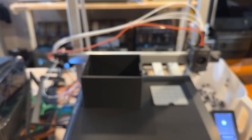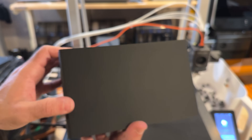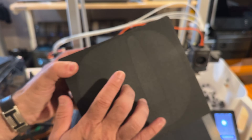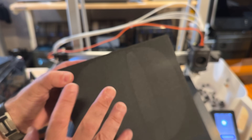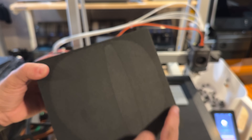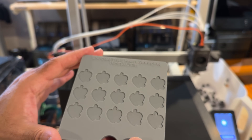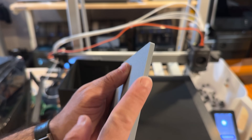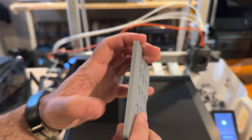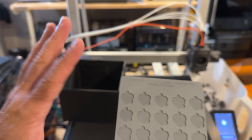We also produced an ink box — it doesn't require a massive bed but I was happy with the overall quality and dimensional accuracy. There's some discoloration on the bottom; I think I took it off the bed too soon before it cooled, and flexing it to remove it may have caused that color difference. From a jig perspective, we also printed jigs, which is a big part of our business. It's important there's no elephant foot on the sides — this came out pretty flat and dimensionally accurate and will fit into the machine without a problem.